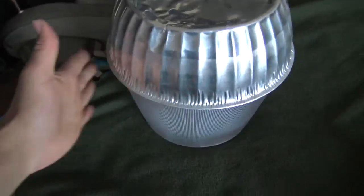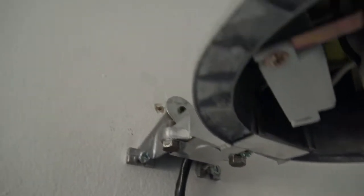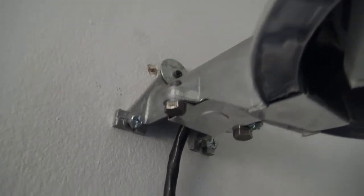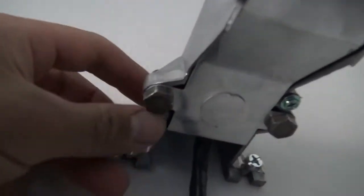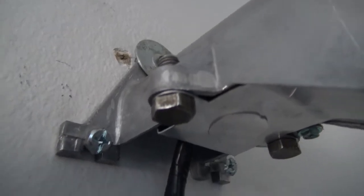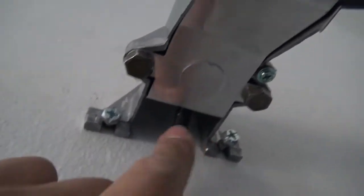This one is just a small one. To mount this particular bucket, it's pretty much made to mount directly on a flat surface. You've got screws — these lag bolts came with it — so I just got it mounted on a stud. This one was missing the screws to hold the piece on, so I put some replacements in. You've got a ground screw in case you want to ground it. You can connect a conduit or a Romex clip in there. I just got my cord routed in and all my wires are spliced in there, going up into the ballasting area.